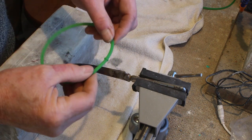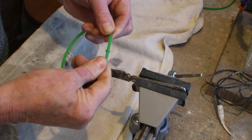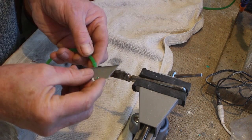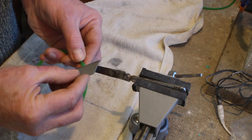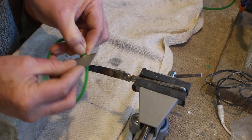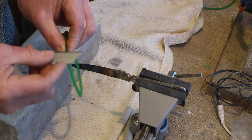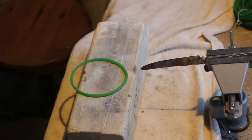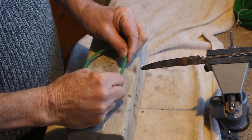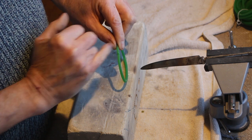The joint is now cool. You can check all the way around it — no deformities, no cracks — and you can pull it; that is a really strong joint. To finish it off, I use a Stanley blade, just sawing and trimming the joint all the way around. Flat cutting scissors are available for this but the Stanley blade works just as well. There we are — one poly belt made and ready to go.